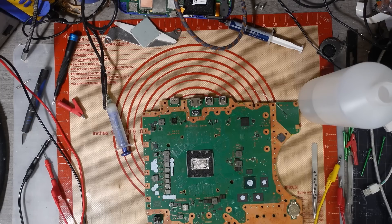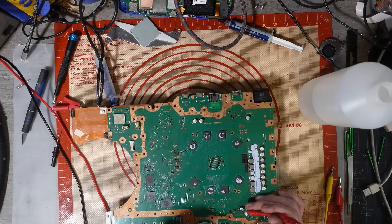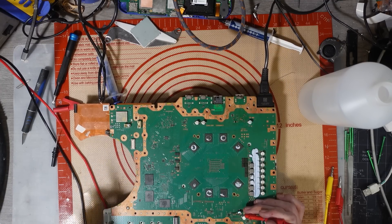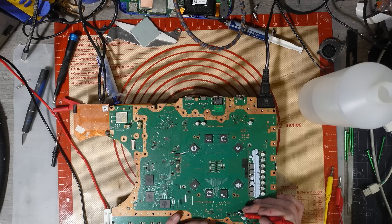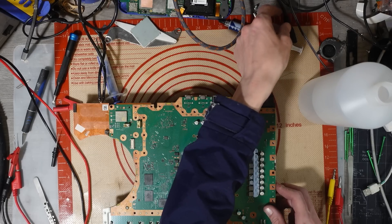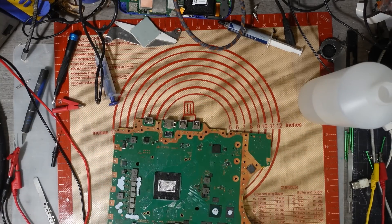It does go back up to a more normal boot sequence now, but it's not quite right — it's jumping up to 40 milliamps and holding there for a second, so I don't think it's turning on still. We've got no short there now. We're getting 0.15 volts but we've still not got 5 volts there, which is strange. There's no short on that line now. Let's try changing that encoder, just in case it did take out the encoder.